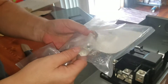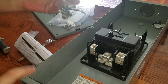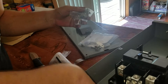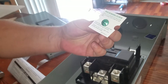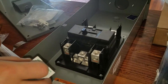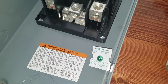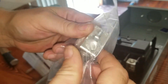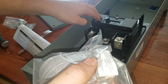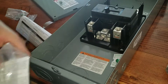Right here is your grounding bar kit. Here are your other screws for the top. These are screws and nuts to attach it. Right here is your box bonding screw — it goes right down here, so you can bond your box to the grounding cable. It also comes with the lugs for the thicker wire, so you can have it bonded in here since that will be your first electrical box, and then run it to your enclosure inside and not have it bonded.